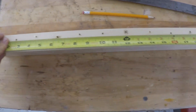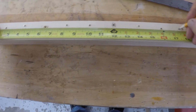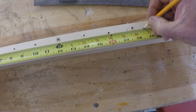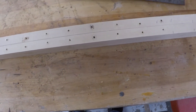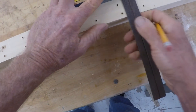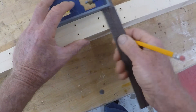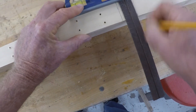From this edge, I'm marking 17 and a quarter and 18 and a half inches. Remember when marking, we use a V at the point of contact — 17 and a quarter, 18 and a half. I'm going to put a line through both of those V's. Make sure you keep your pieces even. That line will mark the position for the last slat going in.